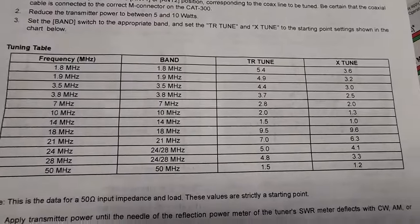If you're hooked up to an amplifier doing more than 300 watts, this is not the unit for you. I like the fact that the band select covers many different bands from 160 all the way down to 6 meters — pretty cool and easy to set up. We did our tests using 20 meters and plan to test 40 meters and others in the future. It's very flexible and you can use it with up to two antennas. I would recommend this — it's available from Comet, great build quality, came completely undamaged. For the Lake Cumberland Amateur Radio Association, I'm KY4BDP Brian. We hope you liked the video — go take a look at the Comet CAT 300 Antenna Tuner and have fun with it. 73.